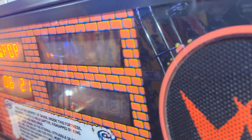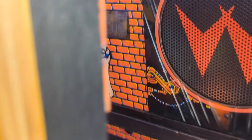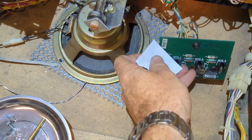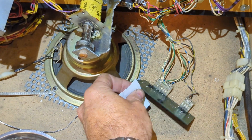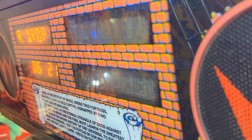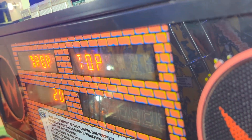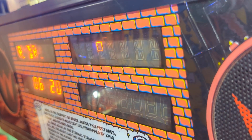So the drop targets — top, bottom, middle, right — those are all working. I'll grab a piece of paper and stick it in there to verify each one. Blocking one at a time: now it's just bottom and middle, so that's the top one. Now bottom and top — that's the middle. Then bottom and top, and middle and top. Okay, all confirmed.